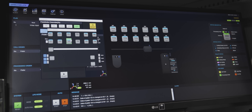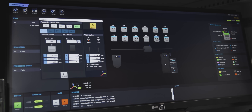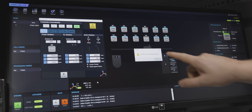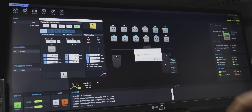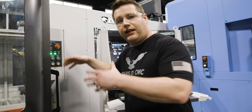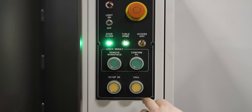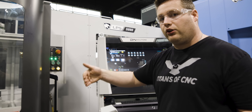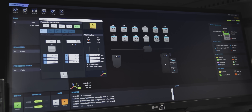I'm going to go from 204 to my loading station. Now if I just hit start here, it's going to give me an alarm and tell me that the loading station is not ready. That's because I haven't told it that it's OK to bring this in. So I'm just going to hit call — that lets it know that it's ready to call a pallet up. So now we can hit start.